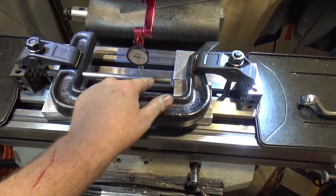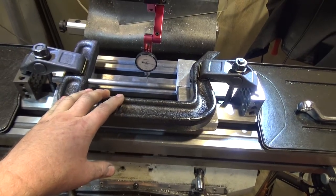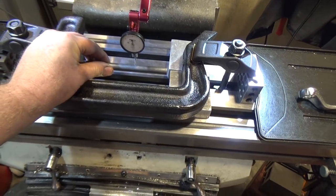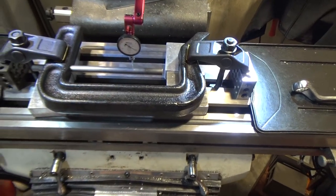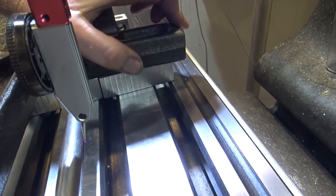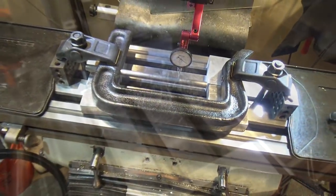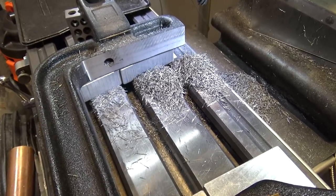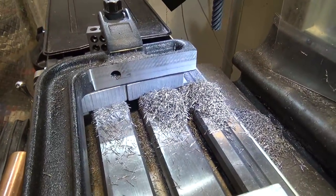I've got this in here and I've lined it up using this bar, which goes through the angle plate on the bandsaw, and then the screw pushes against the opposite side. This is the alignment thing, but as you can see, not a precision fit at all. I got it very close depending on where the shaft is — got it centered. Now we're going to come up and make this side square and hopefully have a better bearing surface, because right now there's almost an eighth of an inch — maybe just a little under, about a hundred thousandths — ridge there. So we're going to fix that. That's nicely cleaned up. Now I've got a good flat bearing surface. If you're curious about how far I went — I said about a hundred thousandths — look at that, that's a hundred thousandths after first touch off. Not a bad guess.